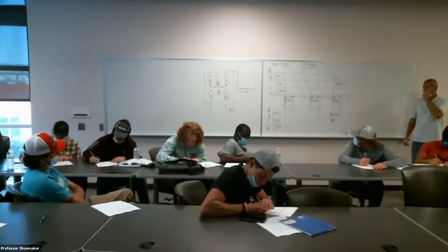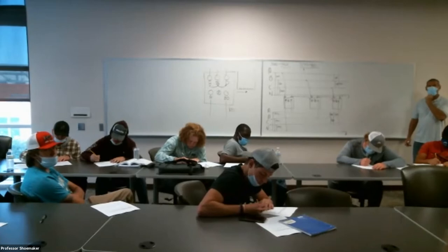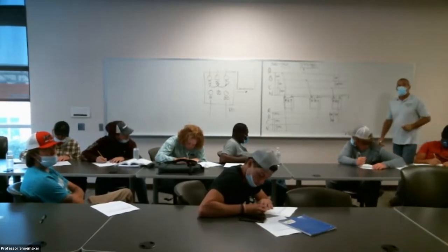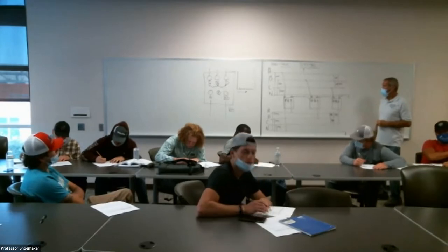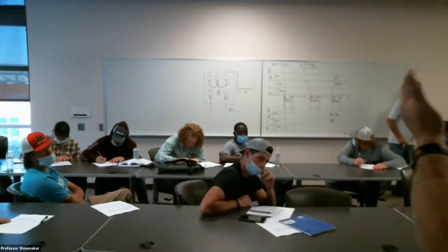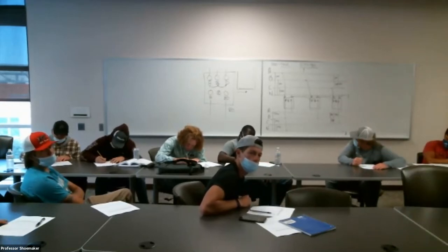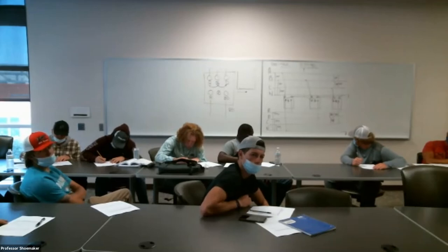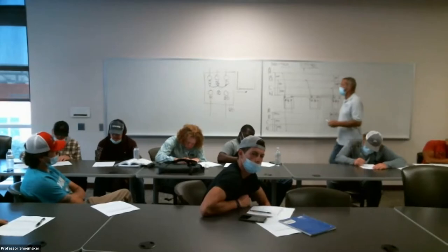Professor B, anything that you'd like to include here? Yeah, I omitted something just watching you from yesterday. Guys in my class, on the primary side of the transformer, the bushings, he said it was H1. They're designated H1, H2 on the top side right there. So just wanted my class to know that when he says H1, that's your incoming voltage in the transformer, H1.